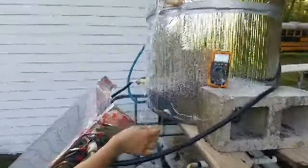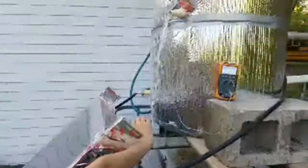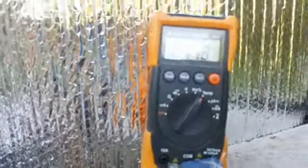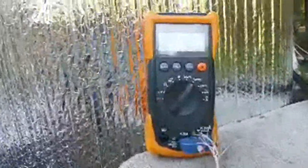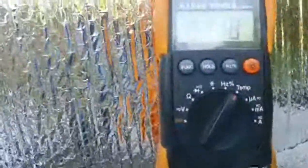Well, it's about 3 degrees shy. Now it's 118. 118, 117. I think we've reached, now it's dancing between 118, 117. I think because of the mixing, we've reached the top level of hot water. It is unlikely it's going to go any higher than that, unless the very top layer of the layer cake is higher than 118.